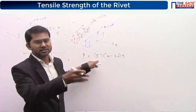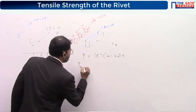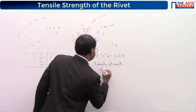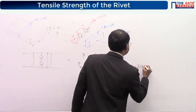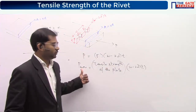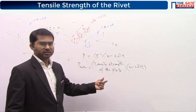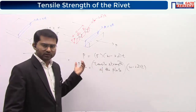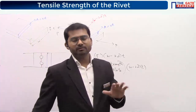This sigma cannot exceed the strength of the plate. The maximum load carrying capacity p_max equals tensile strength of the plate into w minus 2d into thickness. The load carrying capacity depends on the plate material, since each material has its own tensile strength. To identify the area, just identify the cross-sectional area and write down the load-stress-area relationship.